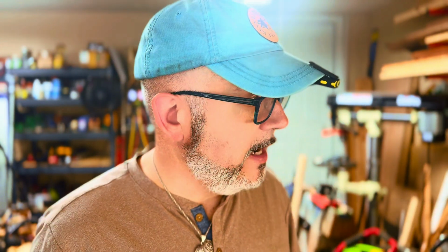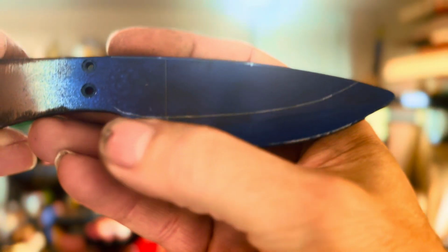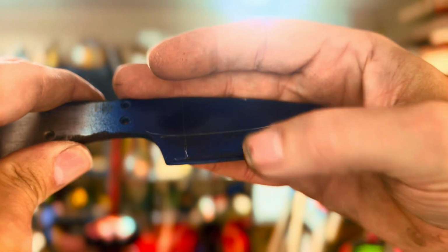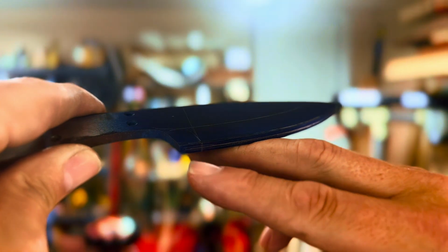I'll try to leave a link in the description where I got them, because from what everybody said, it's hard to find them for a 1x42, I believe is what this is. As you can see, I've got my lines laid out for my plunge lines, and these lines are where I will grind to. So from here to here to make my bevel. I'll put a choil right there.